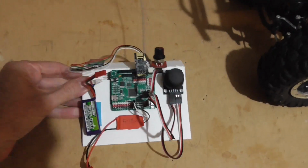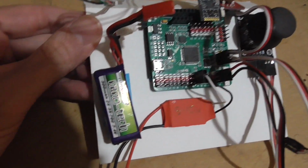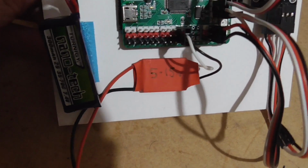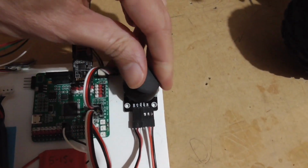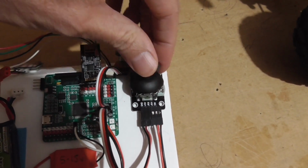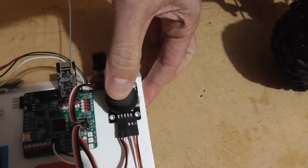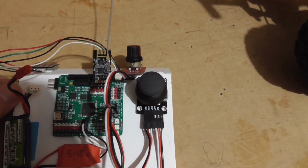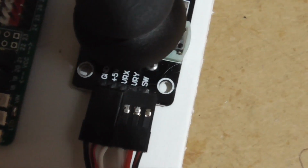So let's just have a look at this. It's just a quickly slapped together piece of foam board, and we have S-Bus mixer in the middle, a little battery there to power it with 5 volts, and then we have a joystick. So this is basically just 2 variable resistors or potentiometers in there, one for vertical and one for sideways, and then it actually has a press button in it which I'm using to switch modes between manual mode and the Follow Me mode. As you can see, there's a little SW there on that last input.